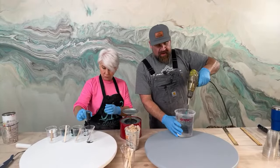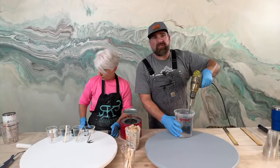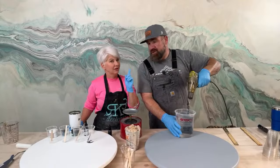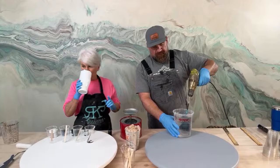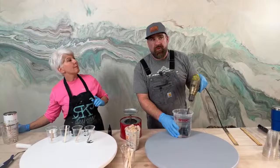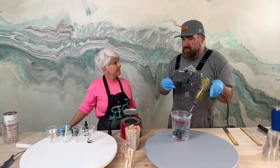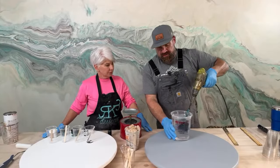And that being said, you could still torch it up to 35, 40 minutes down the road if you're doing a clear coat. I did woodworking with this product. I applied a 4 ounce per square foot seal coat over redwood and a river table. Not a skim coat. I omitted the seal coats. I went right to 4 ounces per square foot, and I had about 15 knots on that piece. All but two were filled up. So I went 4 more ounces on top of that. That bar top, which is now in Renovation Hunters, has 2 coats of this stuff. Solid, beautiful. I finished the whole woodworking project in 1 day.